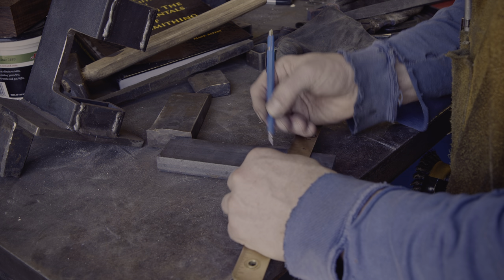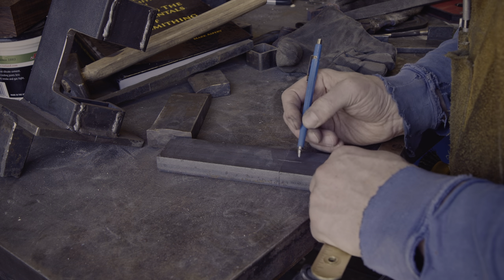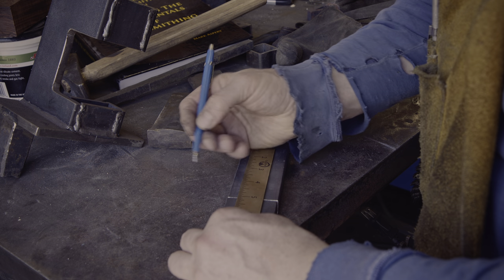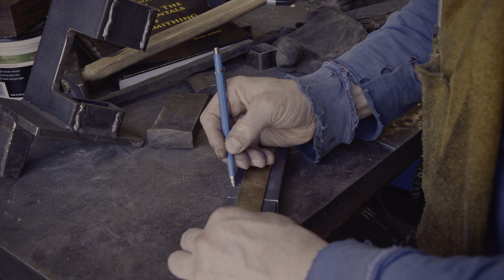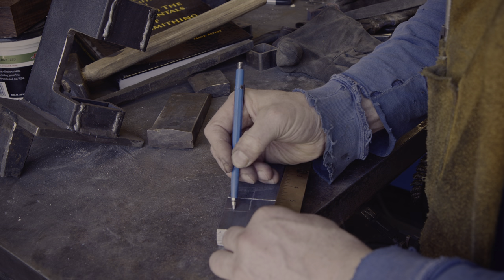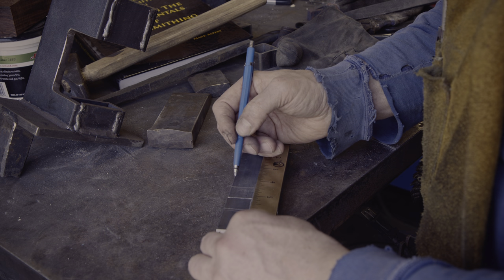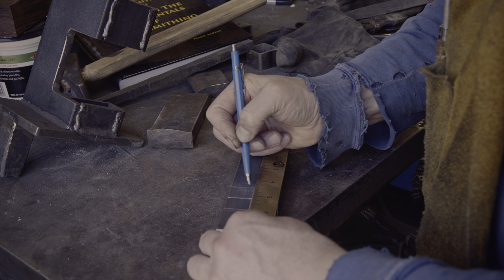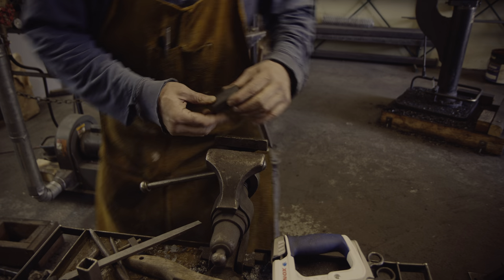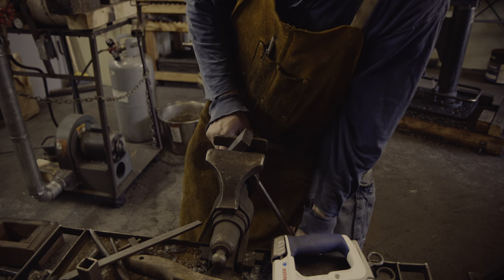As I am looking for a 45-degree angle, I'm marking a line three-quarters of an inch away from the cut end of each die. The main challenge will be to cleanly remove the extra metal. I'm thinking I will establish the separation between the chisel and the flat die with a saw, and then grind and file off the excess metal. To do that I'm clamping the die at a 45-degree angle into my leg vise.